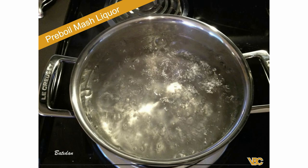This doesn't provide active protection against your dissolved oxygen. It just gets it down to 0. If you let it sit in atmosphere, the air will reoxygenate the water, as we mentioned before, at 1 to 2 parts per million per hour. However, this is kind of the cleanest method. You're not adding anything to the water. You're just pulling the oxygen out.